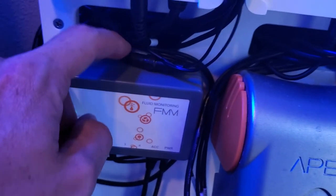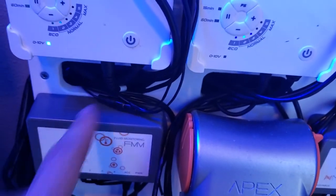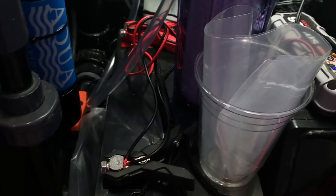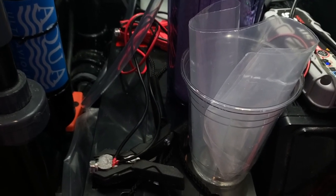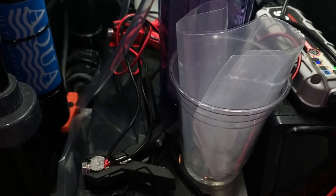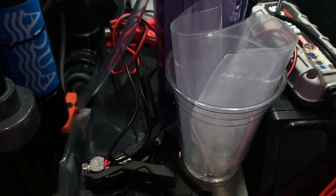One more tip: if you're wiring for an Ecotech pump, the positive side is going to be the fuse side. When you're wiring the Ecotech wire to your bigger wire, make sure the fuse side goes to the red (positive) wire — otherwise it may not work correctly. I tested it with a voltmeter and was reading just over 12 volts, so I knew it was good.